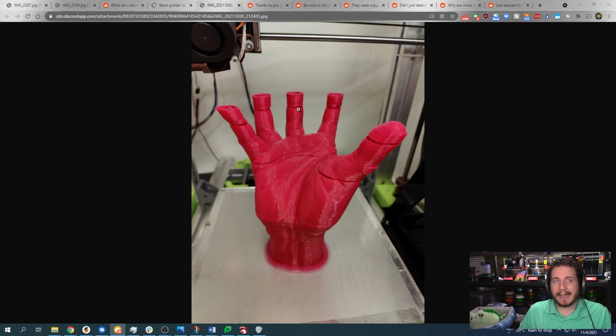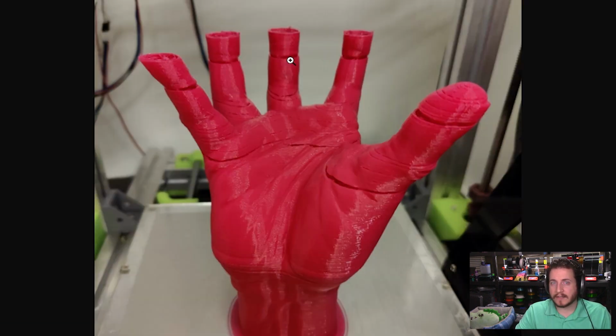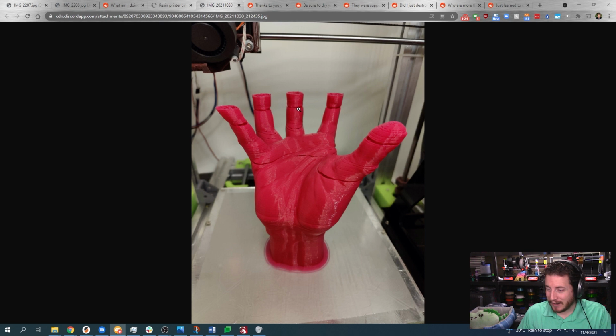He's using GST3D PLA, which I've talked about in the past. I'm wishy-washy on him. He said he's had good experiences with them. So what's this? I have not had great experiences with them, but this is a nozzle clog. You can see that we have some pretty rough under extrusion. It fixed itself, some more under extrusion, it fixed itself, some more under extrusion, some more under extrusion, and eventually it straight up failed. This is a partial nozzle clog.